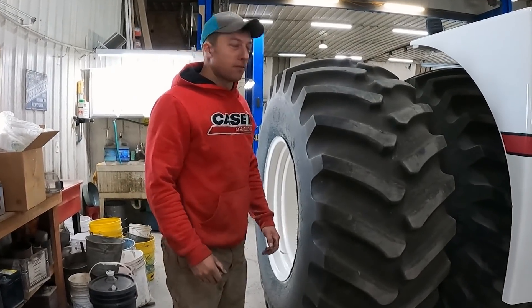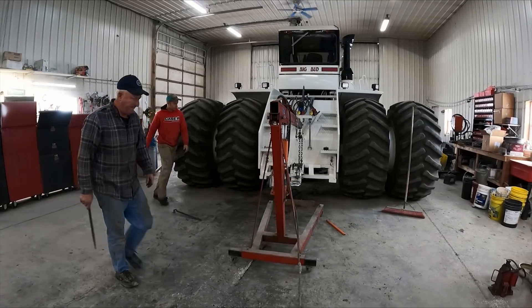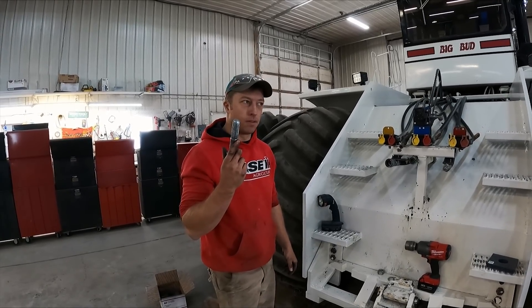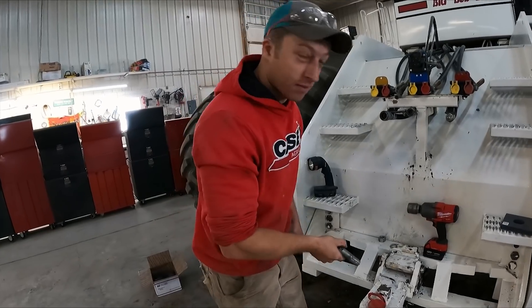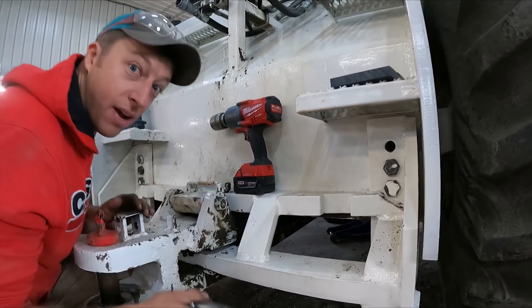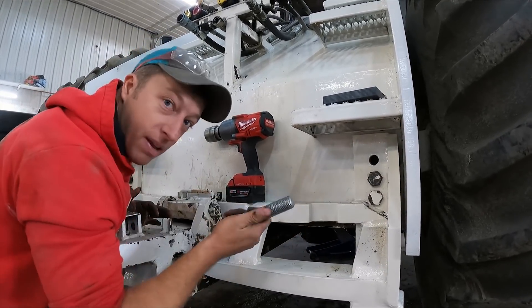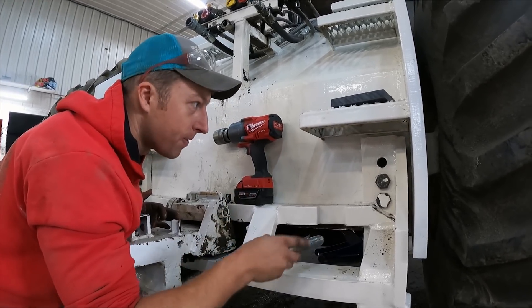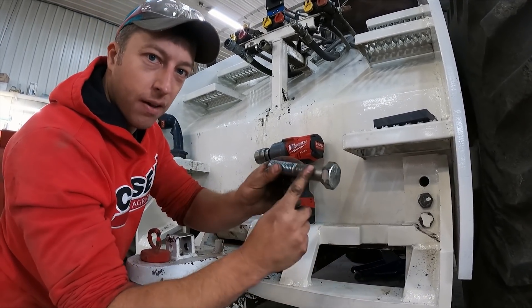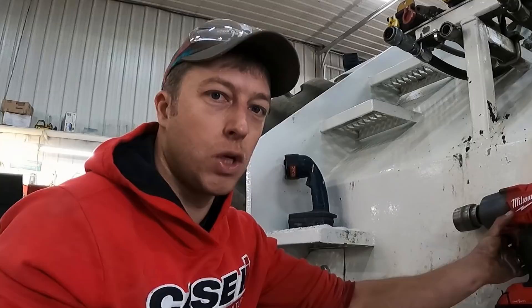Okay, go up — not too far, go forward a little bit. Now in — Leg Iron Arms did this. He noticed that there were only four bolts holding this whole plate on and there was an empty hole, so he went to town and got some big bolts, put one in that side, went to put one on this side and it doesn't line up perfectly — messed the threads up really bad. So I put a thread chaser on and cleaned the threads up, but it's still hitting there. There's an edge on the non-threaded part that's too thick, so I'm going to put it on the lathe and turn it down a little bit and see if we get it to slide through and tighten up.